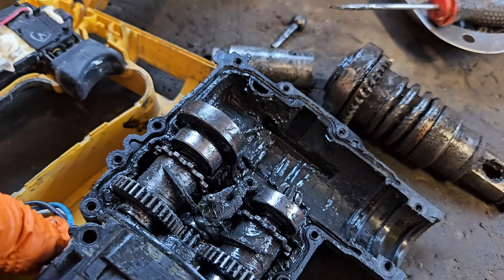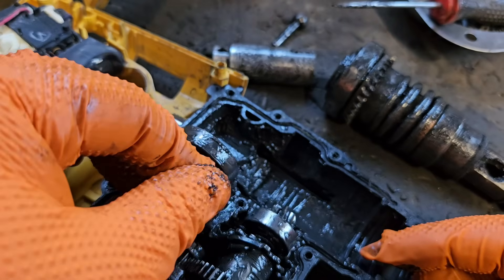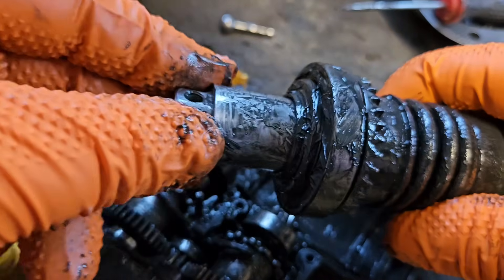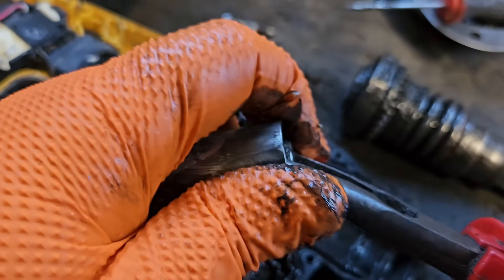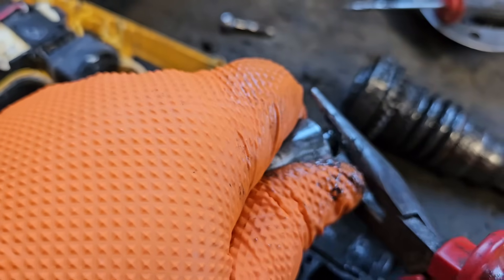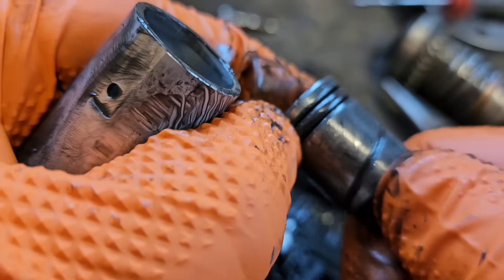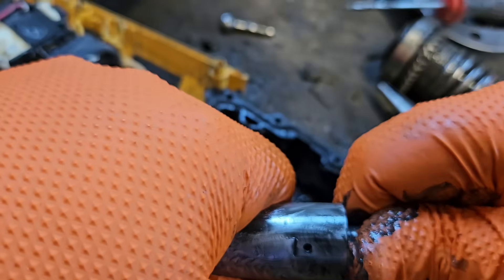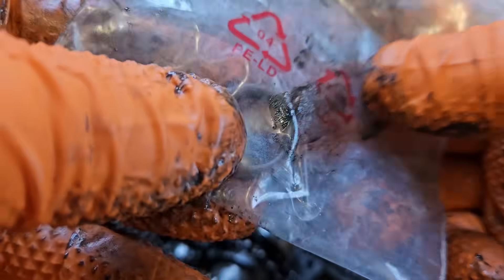So to recap, once you've got it out this far, you make sure the motor's turning, which I have done earlier. You make sure these turn and aren't broke. You make sure that's not bent and is activating both things. You make sure that's not broke. And you inspect this for either being jammed or broken. There's an O-ring on here. I'm going to show you here. That's actually okay, that one. Sometimes this O-ring can be broke. Sometimes this part of the mechanism can be completely dried out. Now we'll grease that again.